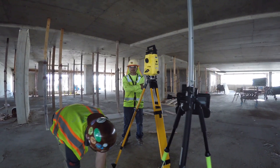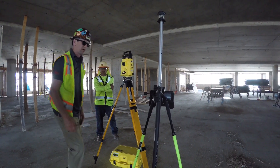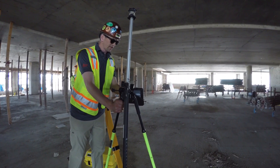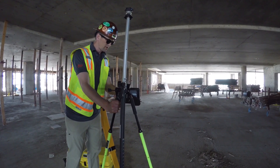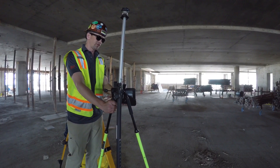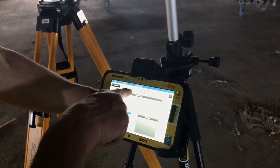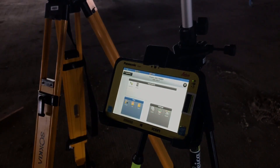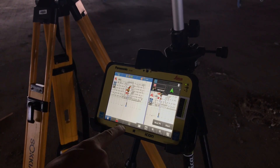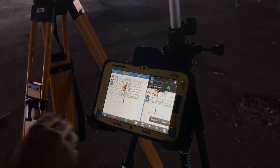We're going to close the case. After we close the case, it's just a good idea to tap it out of the way. Then I'm going to come over here and hit power on my tablet. I'm going to wait for it to load — it'll take just a second. It'll show you your project name at the top and the floor you're on. We're on the sixth floor right now. We're going to go into layout points and immediately into our setup. It looks like our total station is set up in the right spot, but it's not.